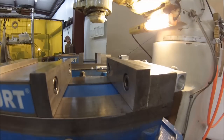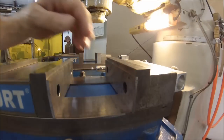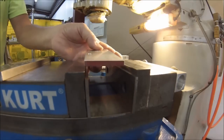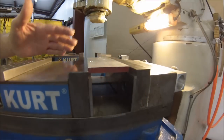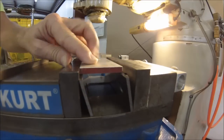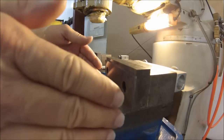Today I'm going to talk about some of the most basic stuff in machine shop — just putting your part in a vise. I think everybody puts their parallels against the jaws like this, closes the jaws down. And this is actually what inspired this video. I watched someone having a little bit of difficulty doing this. You get the part down, you tap it down if it's your second side, whatever you got to do. And when you open it up, lo and behold, that back parallel starts to fall down. Well, there's a million different solutions, but I'll show you the one that I use quite regularly.